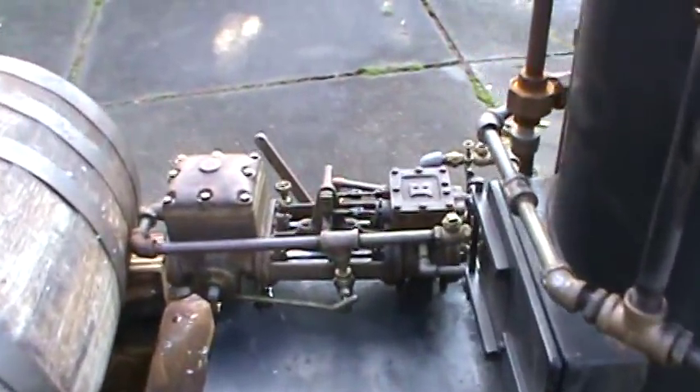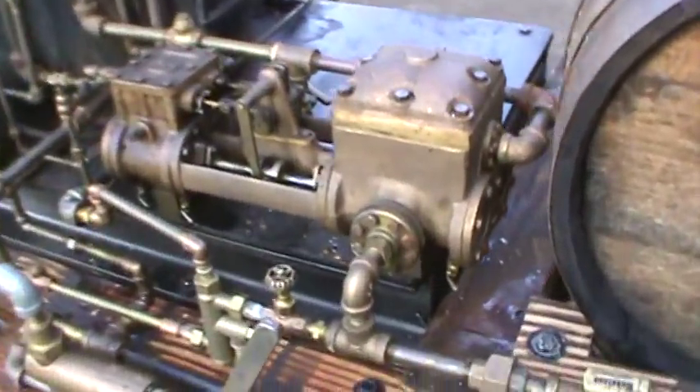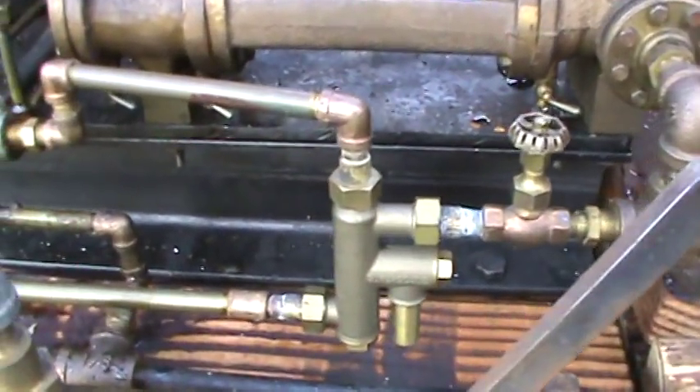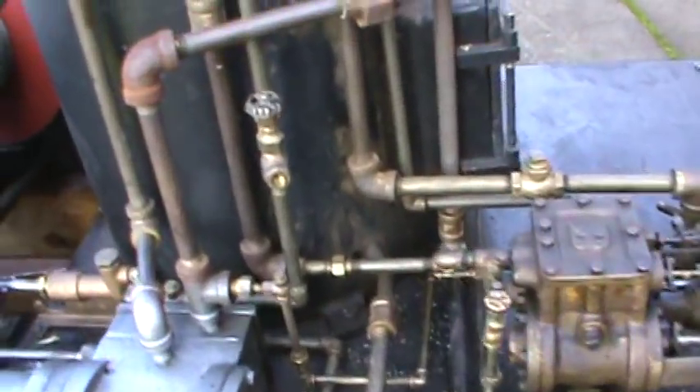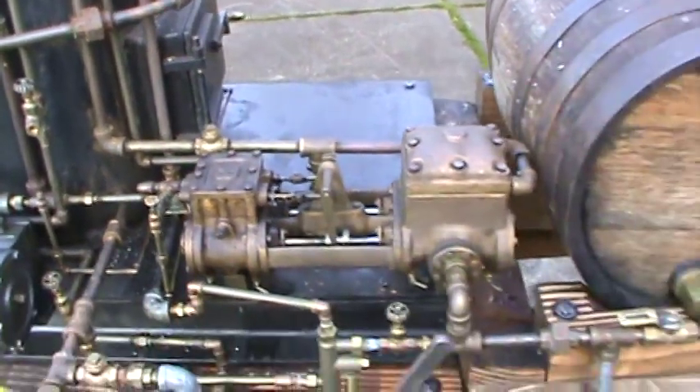It's got a great water pump over there. It's got an injector on it — a super scale injector, I can see it right there — and a hand pump right there. Also, there's a mechanical water pump right back in here. So you've got four options of getting water into the boiler.